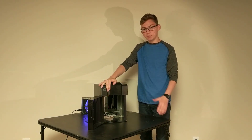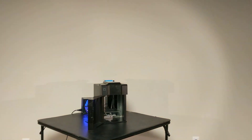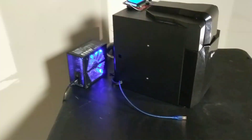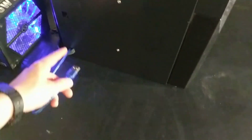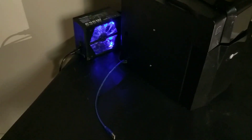I'll do a little explanation and show you some of the inner workings and what I did to make it work. On the outside, it just uses a PC power supply — 12 volts, works perfectly. Eventually I'm going to put a 12-volt power brick inside so it looks more sleek. There's also a USB cord coming out of one of the old ports, so I can upload new firmware or print from a computer directly. On the outside as well, there's an LCD that runs Marlin.